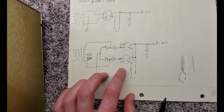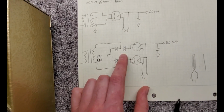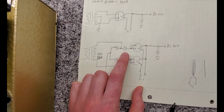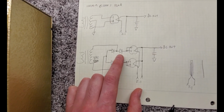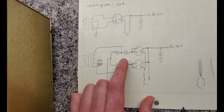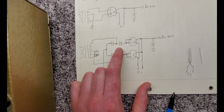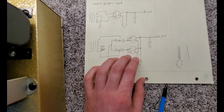So anyway, peak inverse voltage is not the issue, especially since we have these series diodes to balance the reverse voltage. However, if you read online, a lot of people say you need these, they'll save rectifier tubes and all that. Yeah, they're a great idea, and they probably do help with rectifier lifetime and help reduce the voltage drop. But the real problem that these don't save you from, and the reason I think we started having tube rectifier arcs, is the startup condition.